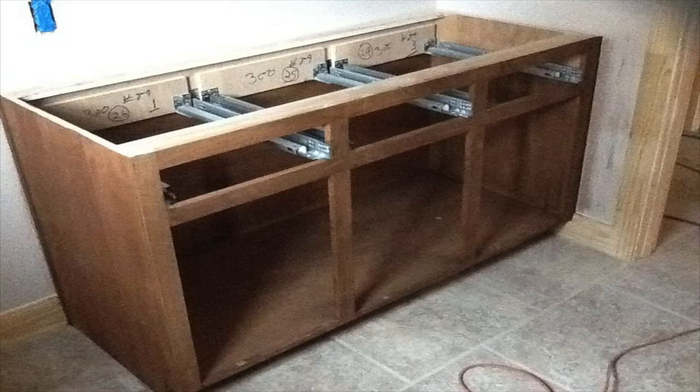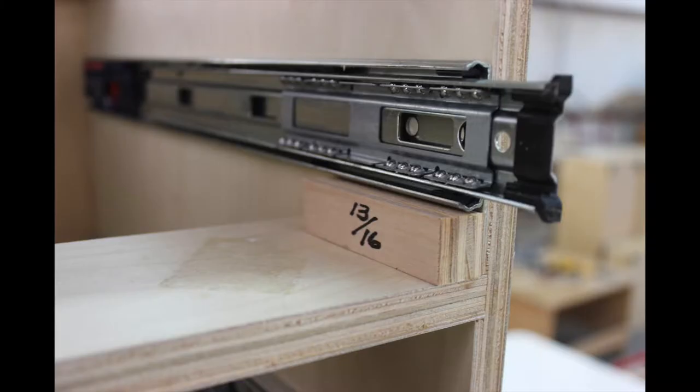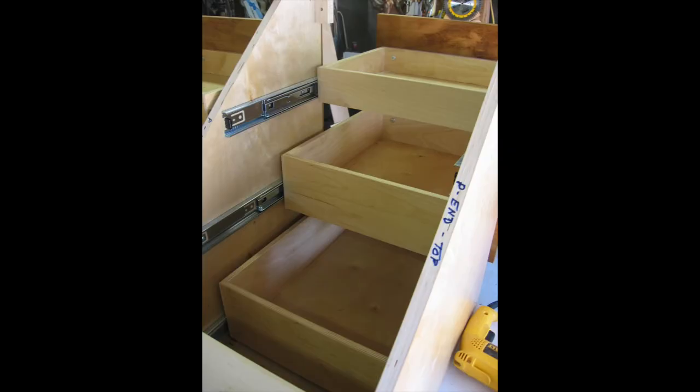The anatomy of the cabinet itself helps us at the front end. In traditional face frame construction, slides can rest on the rails or on spacer blocks placed on the rails. Even with frameless construction, there are usually stretchers or some other structural components defining the drawer openings. The slides can rest on these or, again, on spacers added to the stretchers. The real challenge is how to support the slide at the back of the cabinet.